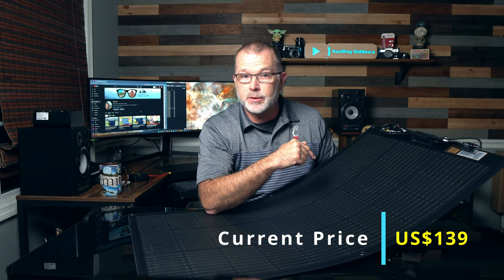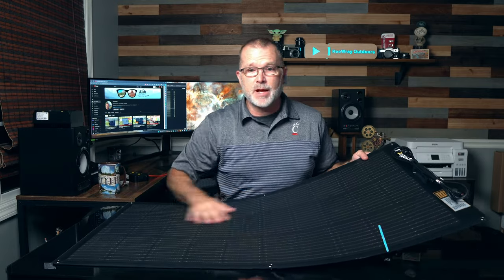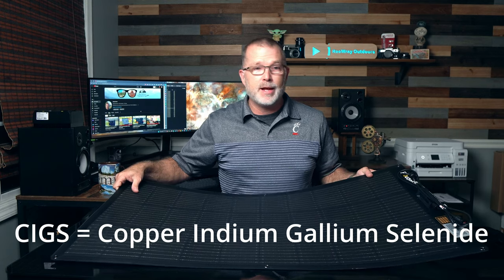The max power current IMP rating is 5.8 amps, with a short circuit current rating of 6.16 amps, and up to a 1000-volt configuration, so you could string a bunch of these in series as long as you don't exceed 1000 volts. This is actually the same construction I've seen on portable panels that cost two to three times as much as this one. It uses half-cut cells and a 10 bus bar design, both of which help provide much better output under partial shade conditions. This particular 100-watt version only costs $139, making it significantly less expensive than a typical portable solar panel. And it's absolutely featherweight, weighing in at under four pounds — basically the same size and weight of other flexible ETFE-type solar panels but at literally half the cost. So I see this as a great general-purpose, rugged little 100-watt panel. Be sure to check out the video description below for links on some awesome Black Friday pricing on this particular panel.